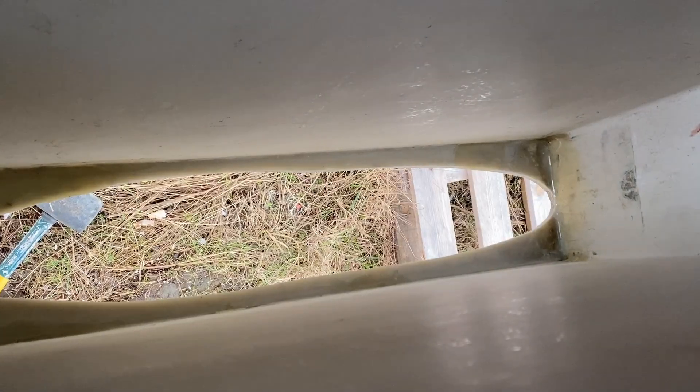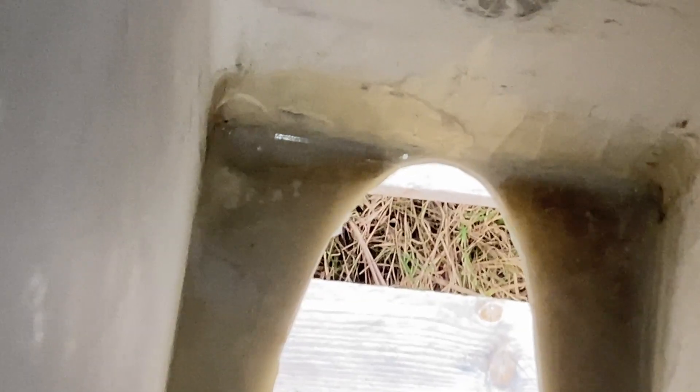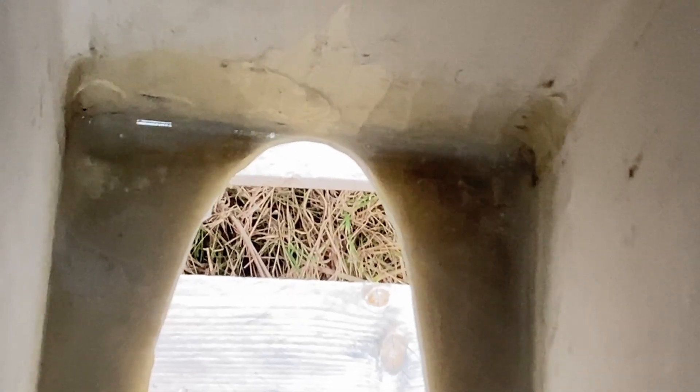It's the next day and I'm going to see if I can get the tray out and see what my repairs are like from yesterday. I just added a little bit more filler and pressed the tray down again. I've just removed the tray and I couldn't be happier, really — this is what I was trying to achieve first time round. It's all really nicely full. I just got to sand all that back now because I didn't use any peel ply so you can see it's shiny — that's the amine blush. I've got to sand the shine off and clean it up a little bit, then I'm going to epoxy paint it. I'm well chuffed with that — it's completely full, exactly how I wanted it.